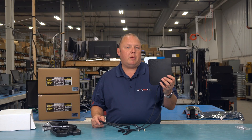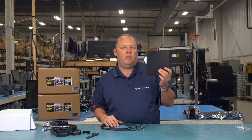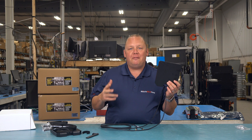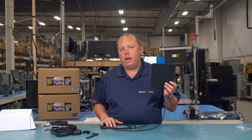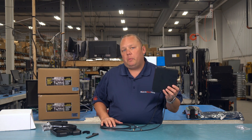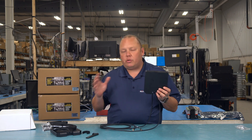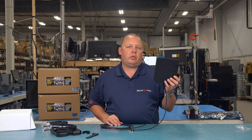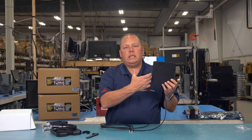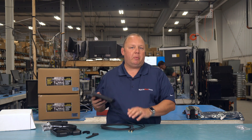Because this is a 2x2 MIMO cellular device with two cellular antennas, this single antenna kit is going to work for category 4, category 6, category 7, and category 12 devices. Anything that uses two cellular antenna connectors is going to work with one antenna. If you have a dual modem device like our Transit Pro — which may have dual category 12s or a combination of category 7 and 12 — you can pick up two of these and mount them next to each other. The manufacturer recommends four inches or more of distance apart so they perform without interfering with each other.